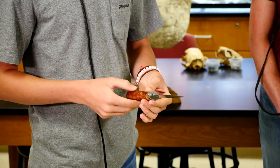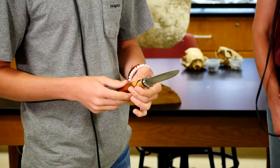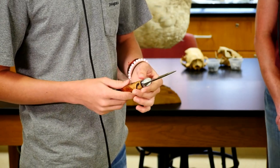It's beautiful. Yeah, I was going to ask about those pins. Do you measure those out and hammer them in? Or how does that work? So with the pins, you don't have to be super accurate, because when you're at that block stage, you'll put them in and they'll be sticking out of the side, but then you just grind them to the face. Okay. But with one of these, it's a little more complicated, because with this, you want to peen the pin over so it's wider on the end, so it's more of a rivet holding it together. Gotcha. Even though there's still epoxy, you want that because your guard can shift a lot easier on one of these.